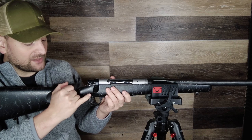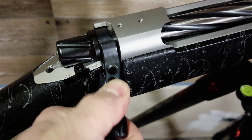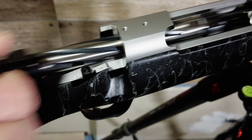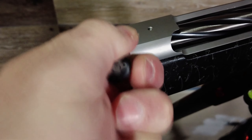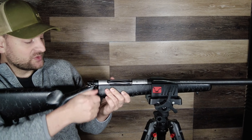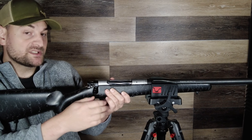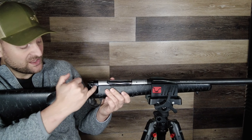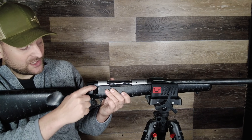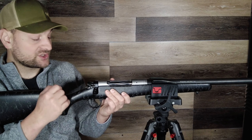Coming forward, you have a removable aluminum bolt knob with knurling, so it's easy to grasp. It features a 90 degree bolt lift, which is pretty smooth but tight, and on the way down it has a little bit of catch — however, it's a very nice bolt lift overall. The bolt handle itself is hollowed out and has holes machined through it to shed weight.